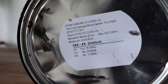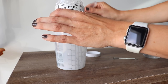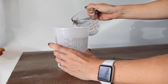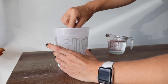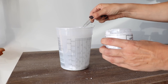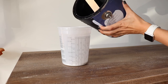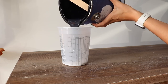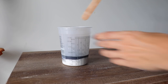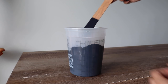My friend had this Benjamin Moore paint in Onyx left over from doing her son's nursery wall, and I said I have this paint transformer — I've never tried it out before, so I'm going to be making my own paint today. This is BB Frosch paint transformer powder. It's 100% natural and you can add it to any type of paint to turn it into a furniture paint. You just mix a couple of tablespoons with water — you want to get the consistency of donut glaze, they said. Mine was too pasty at first so I just added a little bit more water. I mixed up enough transformer for eight ounces of paint, added my paint up to the eight-ounce line, and then stirred this all up, scraping the sides and the bottom to make sure it's all mixed up really well.